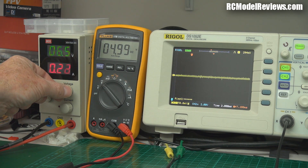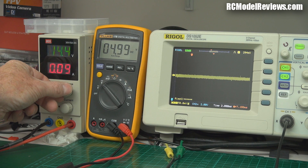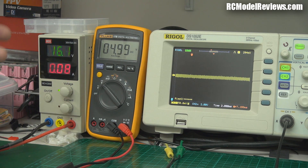Now let's go up — let's say we're putting in a four-cell pack. We'll go past 12 volts, past 13, past 14, past 15, to 16 volts. Look — it's still five volts out, 4.99 volts, and the noise remains unchanged. This little regulator performs really really well and for the money you can't beat them. Because you can adjust the voltage it's very versatile. However, a very important point: you wouldn't use a regulator like this set to 12 volts output from a three-cell pack, because once the input drops to less than one and a half volts above the output voltage, the noise goes up and regulation disappears. That is why for 12 volt output applications you want a boost-buck — this plain buck regulator won't boost the voltage when the input gets too low, everything just collapses.